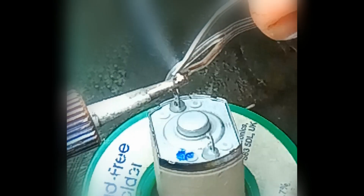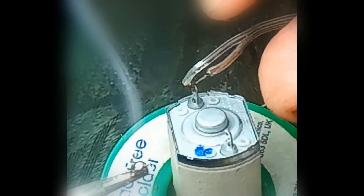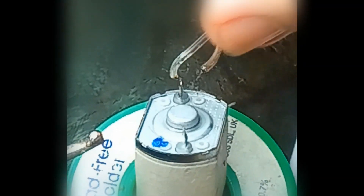But this is the way you do it: put the soldering iron on, then put the iron up, then the solder on top and it should flow. Now this one didn't flow, so what I had to do was go away, give it a scrape, and then try again.